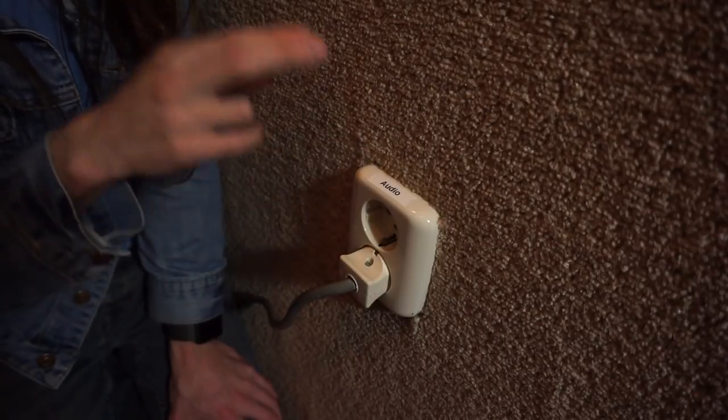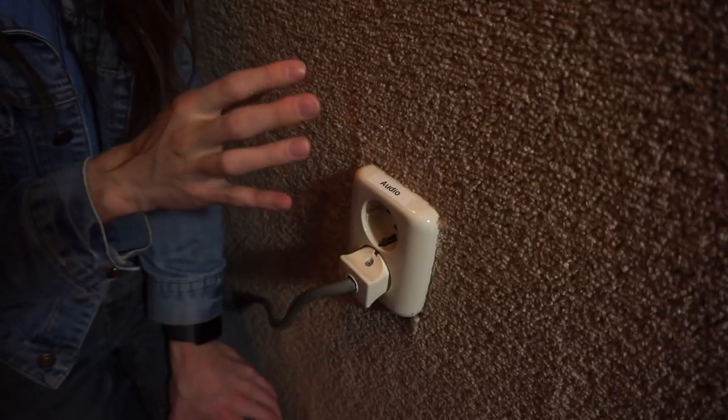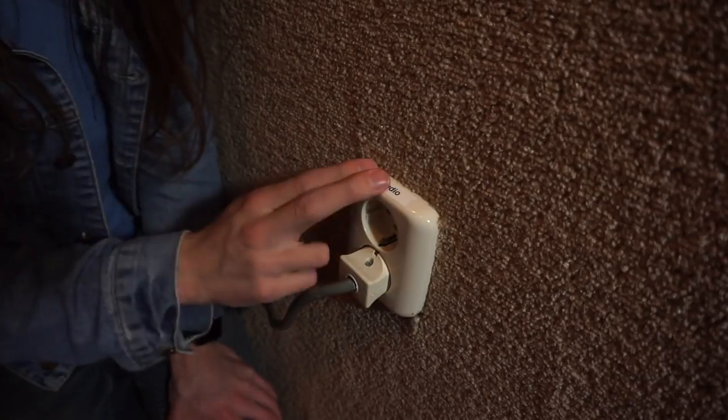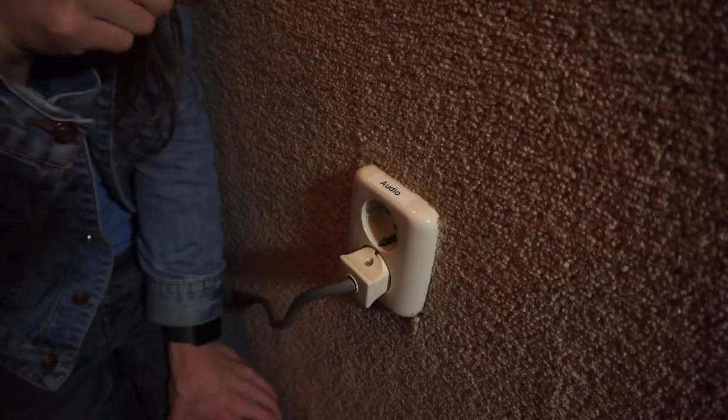I'm in Europe and I need 220 volts. The transformer also gives us exactly 220 volts — not 245 or something higher, as we're in an industrial area where voltage tends to run a bit high. This makes sure our vintage equipment is happy, and it's also noise-free. The fuses on these outlets are automatic, and they are super slow — normally in a domestic installation you'd have standard fuses that cut off almost immediately after you draw too much current.